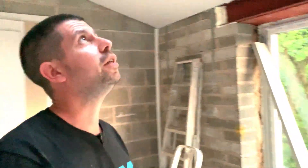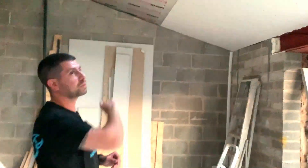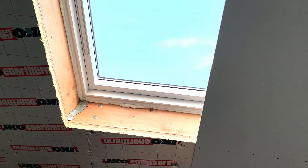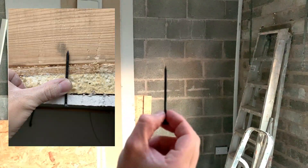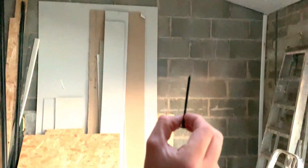Because we've got 25mm of insulation and then a 12mm board of OSB or sterling board and then the joists, I'm using 75mm plasterboard screws — a lot longer than usual — just to get through the insulation and give a good fixing.